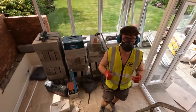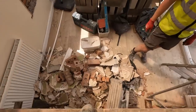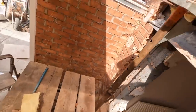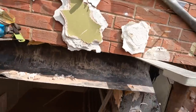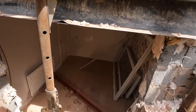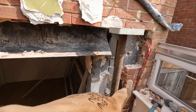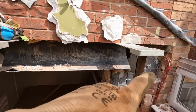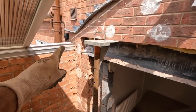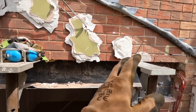Welcome to the chaos. I'm up on the trestles. And the back's out. We started taking the cheeks down. That's almost down that side. This side's nearly down. Gonna have to do a bit of repair work on that. And that's ready for pad stones. That means another two cores taken out. We're getting 150 seating over there, we're getting 250 over this side because it's on the corner.